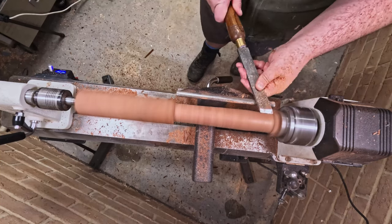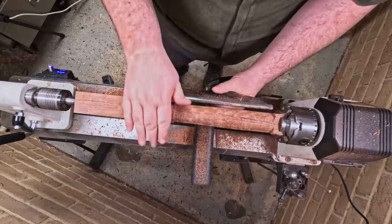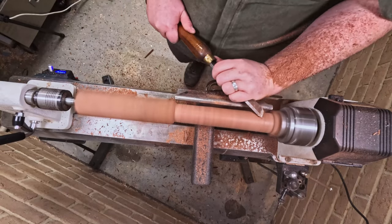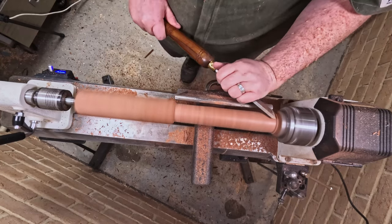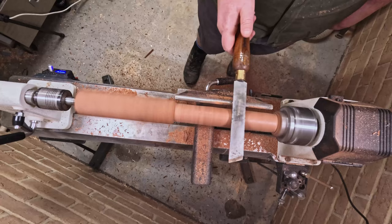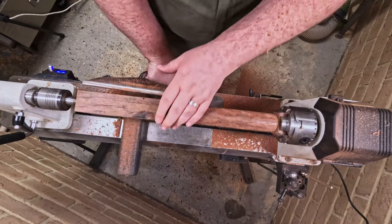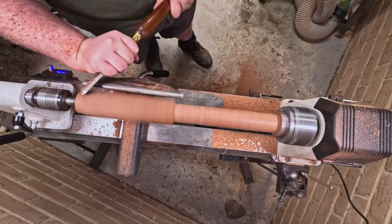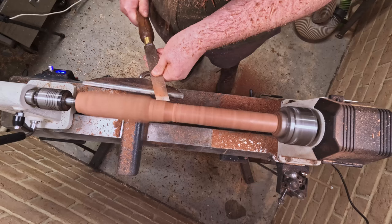So what I'm doing is I am flattening it out. I've done the first half, trying to get it down. I'll turn the tip around and just do a little scrape in, using the entire length of the blade, get it nice and square. As you can see the tool's not bouncing, so I move to the other end — taking in some of SID's advice there of starting at the ends and working my way in.